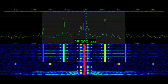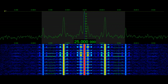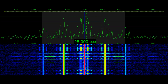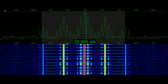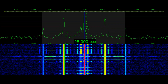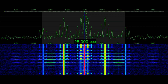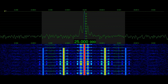The reason I mention it is that it's very important to utilize the highest frequency possible when conducting these experiments, so that you get the best amount of error resolution when trimming your oscillator. These are mathematically driven — the higher the frequency, the more error you'll have. For example, if you're on 160 meters and you're two cycles off, by the time you're on 80 meters you'll be four cycles off, and by the time you're on 40 meters you'll be eight cycles off. That error keeps multiplying every octave. So whatever the highest frequency is that you can utilize, definitely take advantage of it.